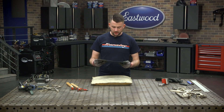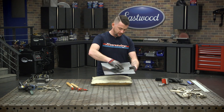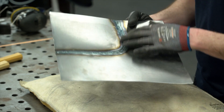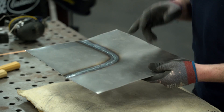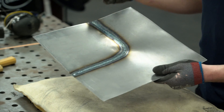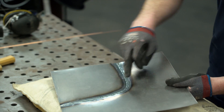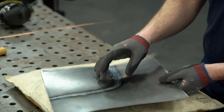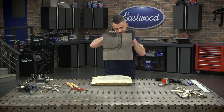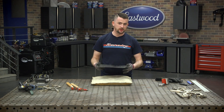Now that we're finished welding this panel, you can see what's known as the heat affected zone — that bluish-purple haze around the outside of the weld that shows how the heat spread into the panel. Also, when I cut the panel, I cut a radius into it rather than a sharp 90-degree cut. That helps spread out the heat affected zone. If I had done a 90-degree cut, I would have had a hotter spot there that would have popped out and needed more stretching to get back.